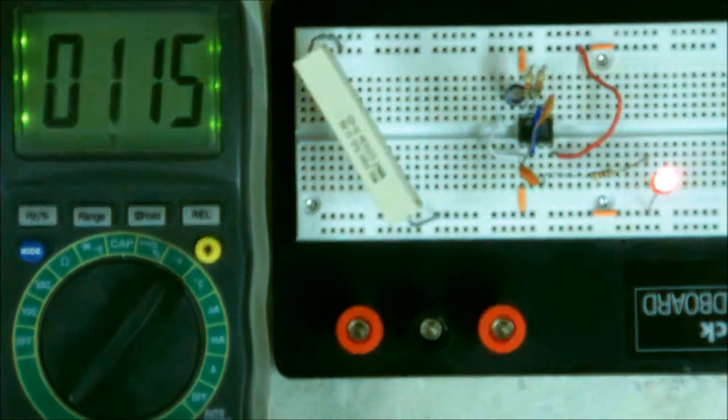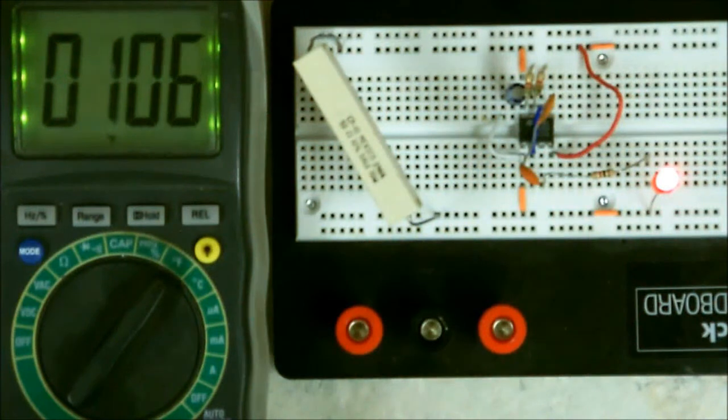Now you can leave this on for a few minutes. We've already calculated the wattage on this thing, and it's well within its limit, and it's picking up right about 5 watts. Which is real safe. The maximum is only 10 watts, but at 5 watts, it can safely radiate the heat from pulling the current.